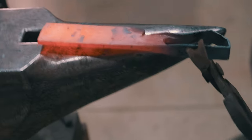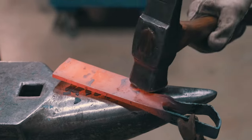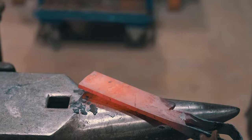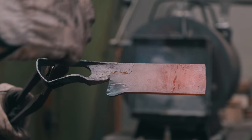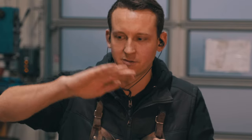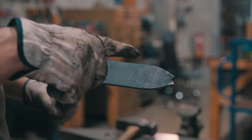After the handle is shaped on the small anvil, the blade still has stock thickness — it's a rectangular piece. We start to forge out the bolster/choil by hand with the cross-peen hammer on the horn and then forge the tip down. That's essentially a step to save material and have material located narrower on the tip. You want roughly a triangular piece if you want to forge a bolster, so you're forging the tip down and the choil out.